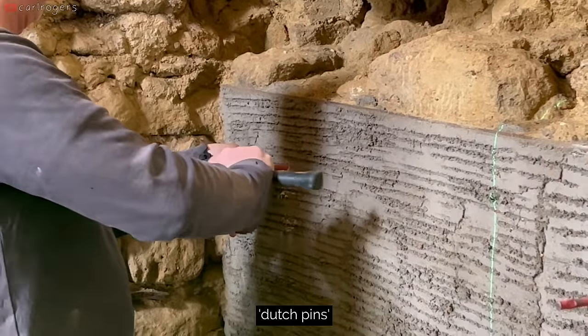On the other end, it was just a simple job of filling in with stones and mortar. And before anyone gets their knickers in a twist about wood being against Portland cement, that's only a problem if you have persistent water nearby. Halfway up a wall with no external sides should be fine.